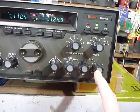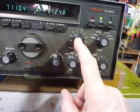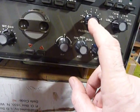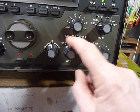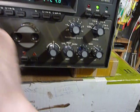This particular unit was modified — it's just a matter of disconnecting a wire on one circuit board. When you disconnect that one wire, then the passband shift, which changes the pitch of the received and transmitted signals, is enabled.